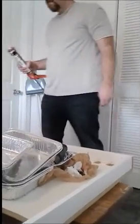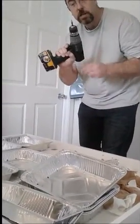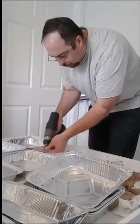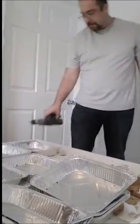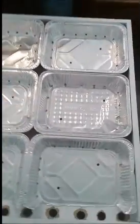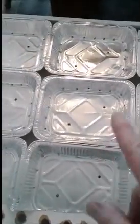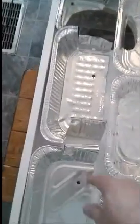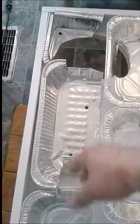Now I'm putting half-inch self-tapping screws into the metal pans — they tap right in nicely. I put a couple of screws diagonally into each pan. I also cut off the bottom lip so the airflow would come in, and bent some of the pans up so the heat flowing out can move more easily. The main thing is getting the metal secured in here.